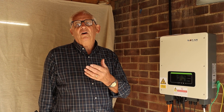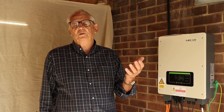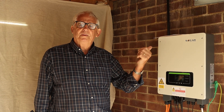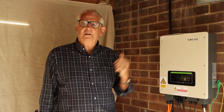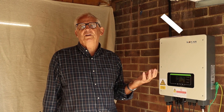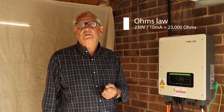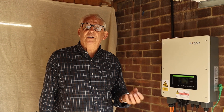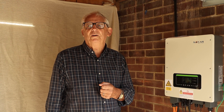For the test, an insulation resistance test is the easiest way of doing it, because all of us have insulation resistance testers. We need to connect one cable to the earth rail up to the PV rail, and one cable to a known earth. We normally run at 230 volts and try to prevent any currents in the house rising above 10 milliamps. Using Ohm's law: 230 divided by 10 milliamps gives us 23,000 ohms. So anything measured below 23,000 ohms becomes an extraneous conductive part, and anything above that we can forget about, because it's not going to introduce 10 milliamps of current if there is a fault.